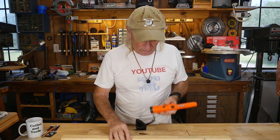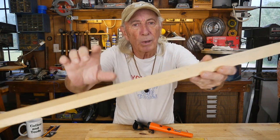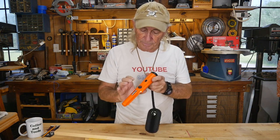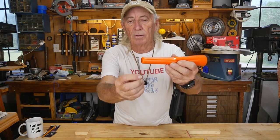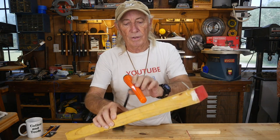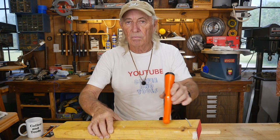I also had a piece of lumber like this one right here — it's got some pinholes from old brad nails — and you're not going to cut this because there might still be something in there. You hit the button, the little light comes on, you can hear the beep, and here's a big bad nail — you can see it sees the nail. Or in this case, a two-by-four with a screw in it — even just close like this within an inch, it goes off.